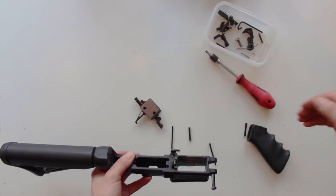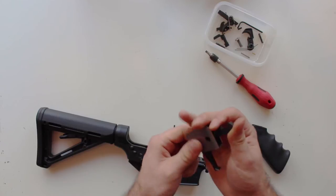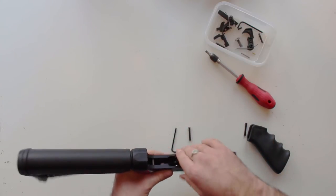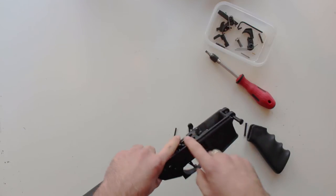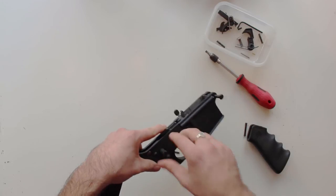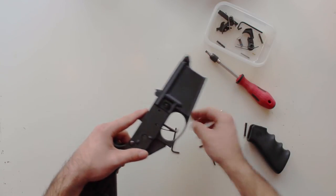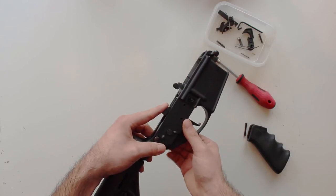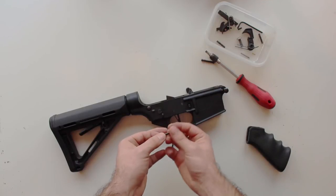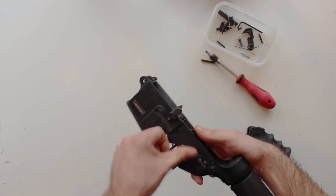That was actually harder than normal — usually it's easier to get the old stuff out. With the new trigger, all you have to do is first cock it so it pushes that back, and you just drop it in — there you go, done. Make sure you don't hit the trigger because it's going to fire forward. Now put the safety back in — remember to put it in the right side, you don't want to convert to a left-handed gun. Put it in before the new retaining pins because you need to wiggle the trigger with a bit of free space. Once it's in, put it down to safety to make sure it's not going to fall out, then put the pins in. You've got the main pin and two screws either side — just undo one and push it through.